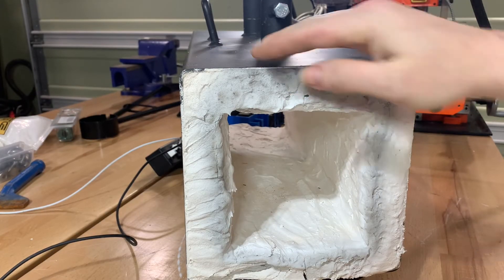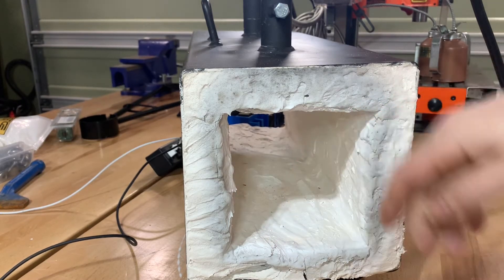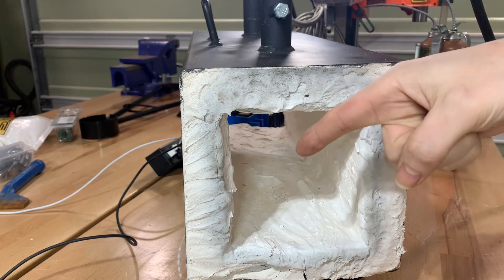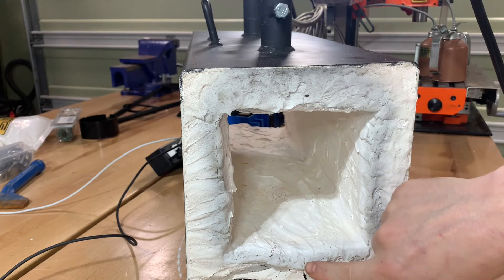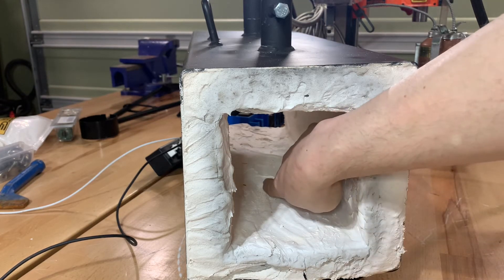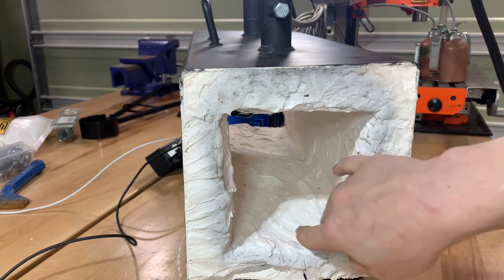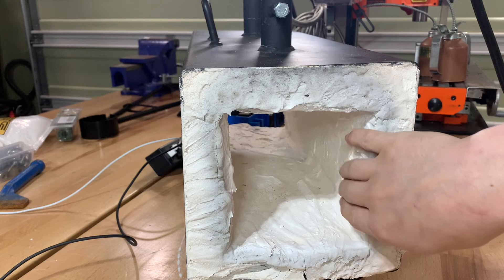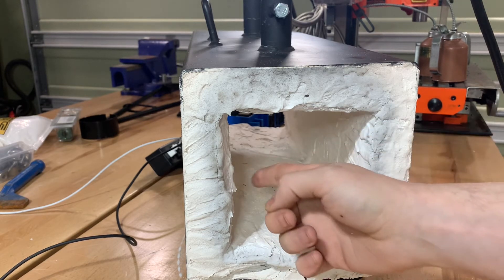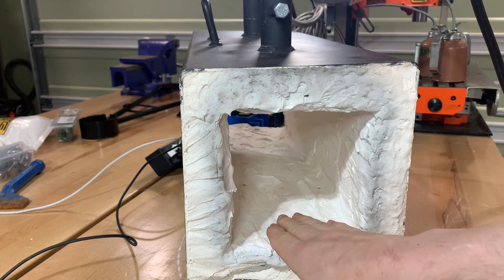This has been resting for about an hour now, it's all cooled off, and it is nice and hard. It's not super hard like concrete — if you push too hard on it, it will crack. You can see some small cracking here and down here, and there's a little bit of chipping on the floor. That's normal. The kaowool isn't exposed, and that's the important part. This is not super resilient — it's not permanent. It'll crack and get dinged up as you use it, and if you push hard on the side it will crack and expose the kaowool, so that's mainly a problem on the floor.